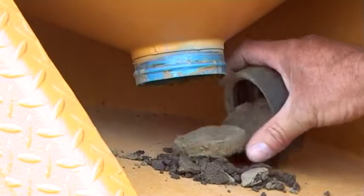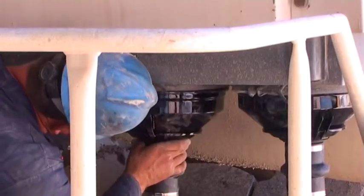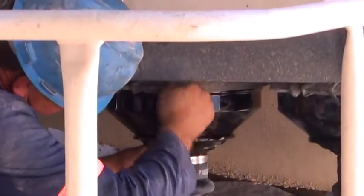Just check the evacuator valve to see that it is not inverted, damaged, or plugged. If it looks like any of these pictures, replace it immediately. When reinstalling the dust cup, be sure it seals properly 360 degrees around the air cleaner body.